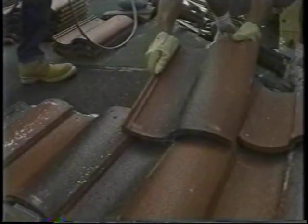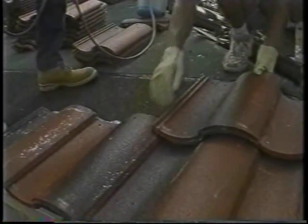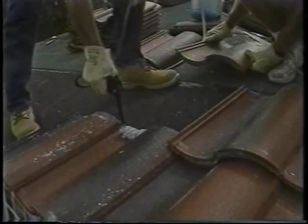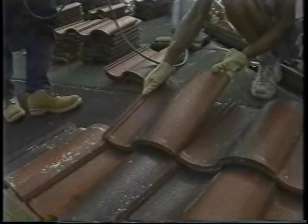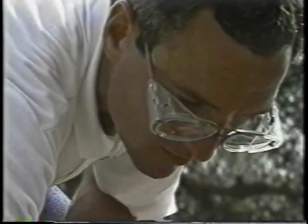For subsequent courses on high-profile tiles, apply the first adhesive pad — 1½-inch wide by 4 inches long by 1 inch high — directly onto the valley portion of the headlap of the preceding course. Apply a second same-size pad at the head of the tile directly onto the cap sheet. The anchor lug and a portion of the pan must be embedded in the adhesive. Both adhesive pads should be on the same underlock side of the tile. Adjust the adhesive pad location to maximize the contact area to the anchor lug.